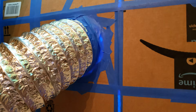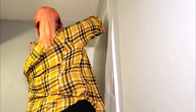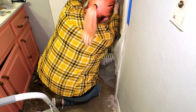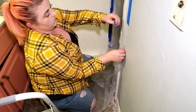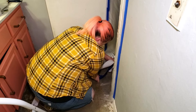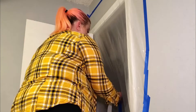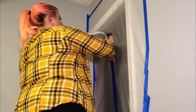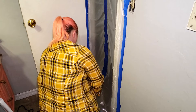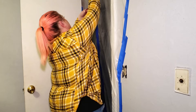The last thing I needed to do to create an airtight seal on this room is to hang a piece of plastic up in the doorway. I still wanted to be able to come in and out easily, so I decided to try out one of these dust barrier zippers. It was super easy to install — it just has a paper backing that you peel up a little bit, then you start at the very bottom of the plastic and stick the zipper to it. As you apply it, you peel a little more of that backing off until you've worked your way to the top. Then you unzip it, cut that plastic along the middle, and now you have basically a door and can easily come and go without breaking your seal.